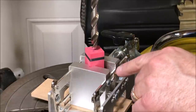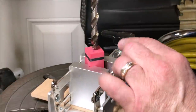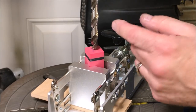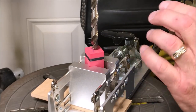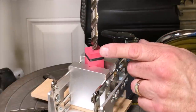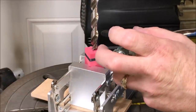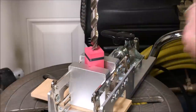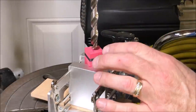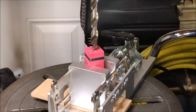What we're going to do now is go ahead and drill the blank out, making very sure that we clear the material and debris from the bit often. We're going to watch the bit to make sure that it doesn't get too hot, because if it gets too hot the plastic can melt into the bit and basically it will swell the blank and can burst the blank. So you want to be real careful anytime you're drilling a resin type blank.